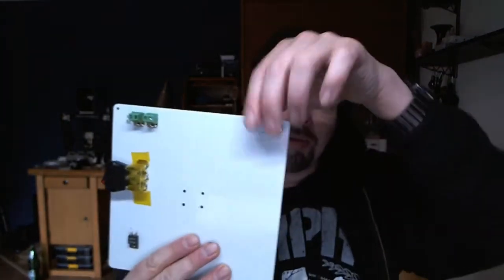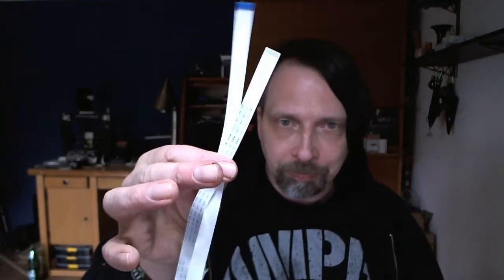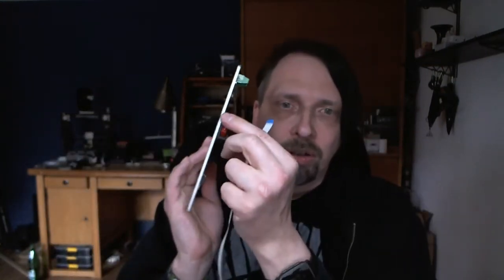Why is it that way? It is because they wanted you to connect these with the heatbed connector of the Cetus, with these cables. This heatbed connector of the Cetus is more or less just connected to a power supply. There is a relay in this, and it's nearly always switched on. So if you turn on the Cetus, this heatbed gets power right away. This is why you can switch it on and off here.